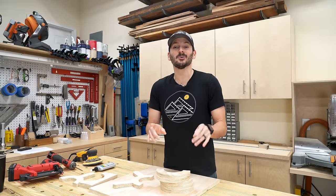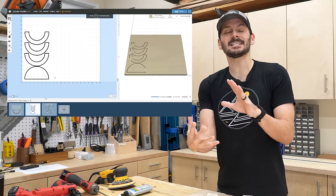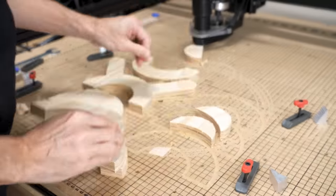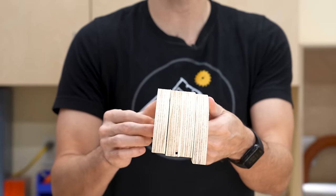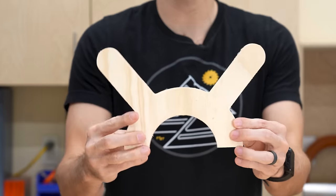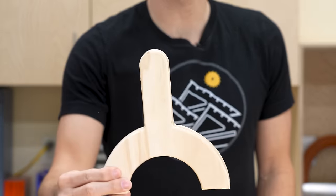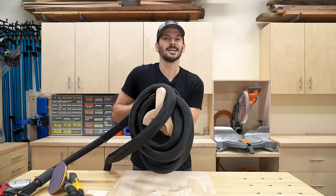I've got some parts here and I think they turned out pretty cool. I just took these measurements and put them into Easel, which is the design software that runs my X-Carve CNC, and I designed some parts that I could stack together to hold the hose on the side of the bench. Then I took them over to the X-Carve and had the CNC cut them out. I love using CNC for this type of work — for making custom tool holders and such, it is awesome. I have a little base piece that I can mount to the side, and then I cut a bunch of these little spacers which are just little semi-circles. As I put these all together, that'll allow me enough room for the hose to sit in. To make sure it doesn't fall off the end, I made this little guy which kind of looks like an alien. But I realized it's a little bit too big for the hose, so I made this other one that is slightly more offensive but more effective. That way I could just drop the hose right over the top of a single piece — I think this is going to work awesome.